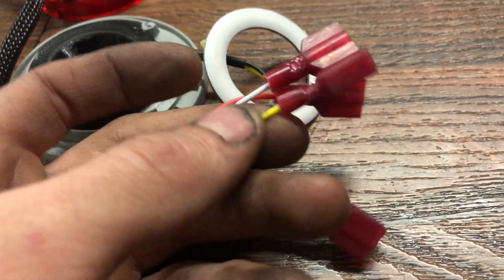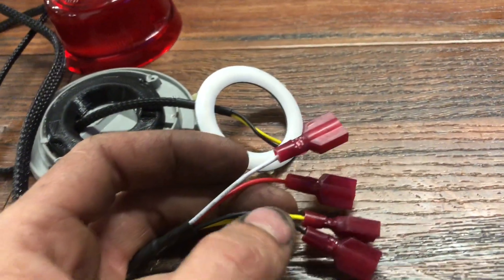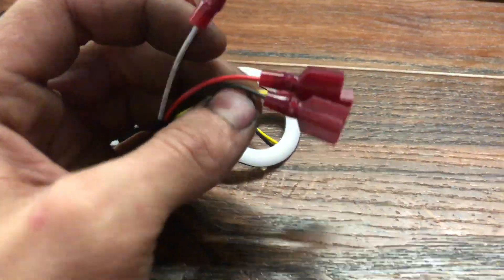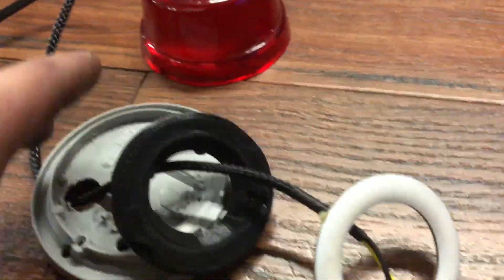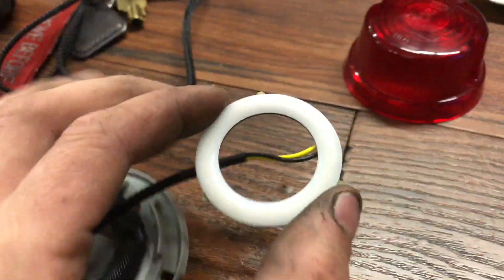It's a ground, tail light, brake light, and then a turn signal. The turn is actually 200% of the brightness, the brake light is 100%, and then the tail light is maybe 50%. Then I 3D printed this guy — it's going to be glued down right there, and then this guy is going to be glued on top of it, and it should work out nicely.